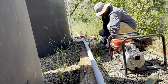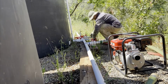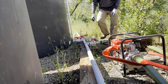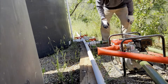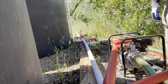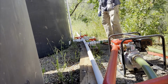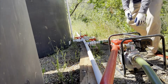To use the pump to pressurize the system, connect the suction and output hoses to their color-coded inlet and outlet pipes. Align the valves so that the red handles are aligned with the red markings. This opens the tank valves, closes the gravity feed valve, and opens the valves that connect the pump to the system. Gravity flow from the tanks will prime the pump automatically, and you should see the flexible output hose fill with water to confirm this before starting the pump.